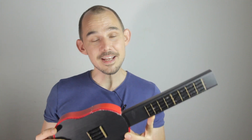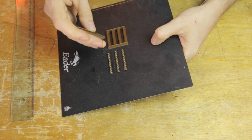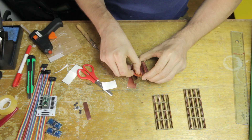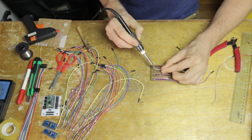The system does have weaknesses, including not being able to play it with a pick or with your nails. The structure for the string sensors is 3D printed, but that's completely optional — it doesn't affect the functionality of the sensors, but simply helps to make a precise base for the sensor material to sit on. So I printed out the basic shape, but I still had to cover it in copper tape and then a dielectric layer. What would be very interesting would be to incorporate conductive filament into the 3D print to see if I can print the whole sensor structure all in one. But to do that, I would need a multi-extruder 3D printer, so I'll have to revisit that in the future — maybe if I sell a bunch of kits, that will make financial sense.